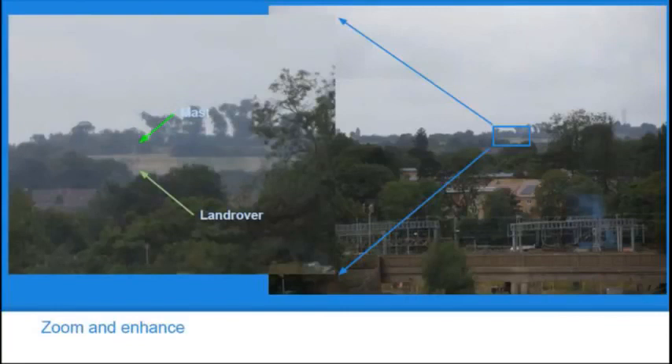So we had 150 meters of fiber running along a rubble and weed-strewn bank to a garage tire and spare parts store, which had a switch and the power injectors for the radios. At around sundown on Thursday we were just about able to get internet to the camp. On the campsite, we also had lots of problems because we discovered that the fiber running from the mast was broken and needed resplicing — luckily we had a splicing kit on site, so we were able to get that fixed.